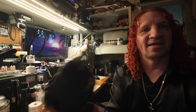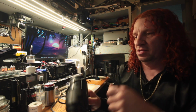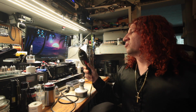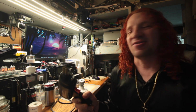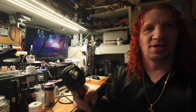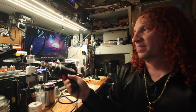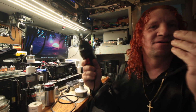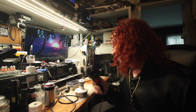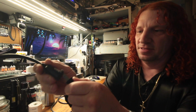I just cleaned the tip too, because it was absolutely disgusting from the last time I used this thing on that other industrial LED. What I use to clean these things is that acid core pipe soldering flux that you use for copper pipes. I got a jar of that, and I get this thing red hot, and I dunk it in there. All kinds of awesome fumes come out, and then you wipe it off, and you've got a brand new clean tip.